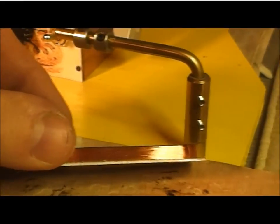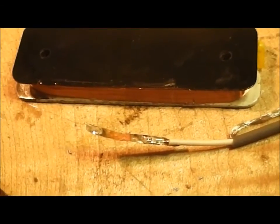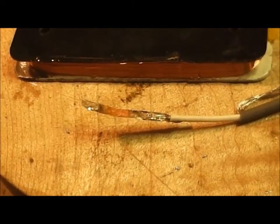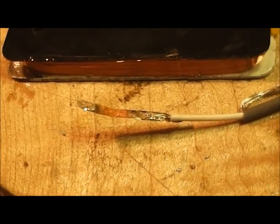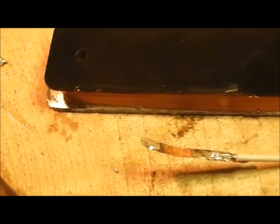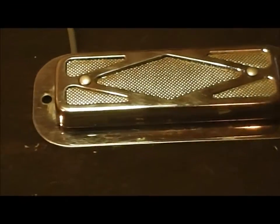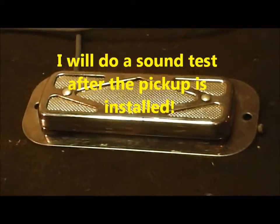All right. Great. So, let's see if I can get this to focus. This is how I connect the tiny 44 gauge copper wire to the lead. This little piece of copper tape right here. And it's just shielding tape cut into a very thin strip. And then I soldered two wires to it. It's good to go. Now I'm going to tape up the bobbin and hope I don't break it. There it is, all done. Just have to install it and dust it out, but pretty cool.